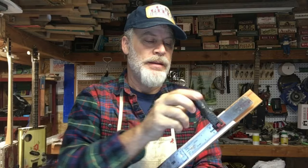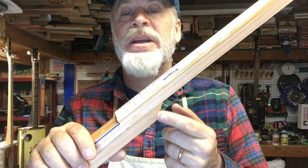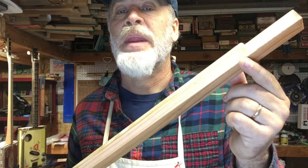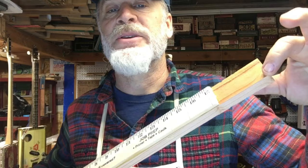and then get her done. Now I'm also going to use the half round router to take the edges off of here and then start filing it. So I'm not going to show you guys that just because I don't want to have to set up the camera again, but I'm going to use my router and route the edges of this and then use my table saw and cut this down and the back angle.